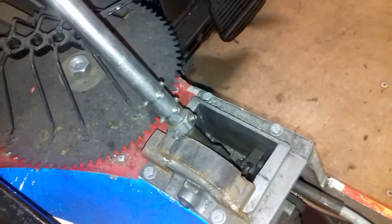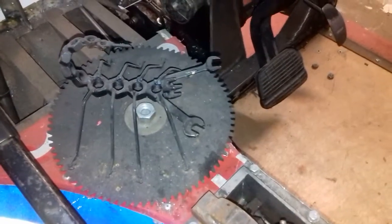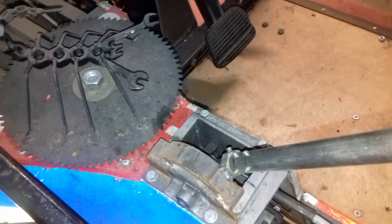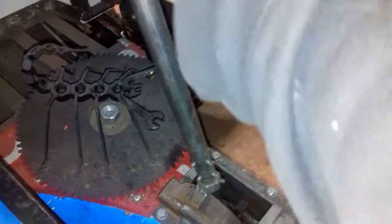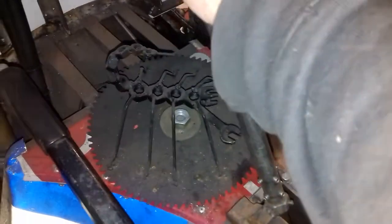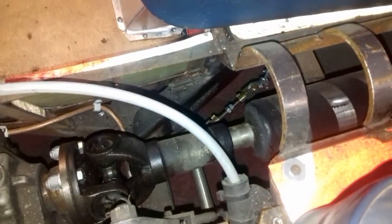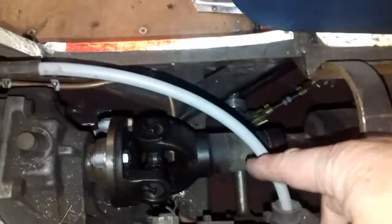The gear stick is actually all functional now. It's a four-speed — when I bought the gearbox I thought it was a three, but it is a four. This adapter piece there wasn't actually made for this rat rod — I made it for a hose connector, found it in my box and it actually works now. So you have to lift it up to get it into park, normal stuff. I haven't actually marked it on here, but this gearbox is a four-speed. This shifter is from a Rover — my offroader — so I had to play around with all the mechanism inside, and it does actually work now. You can feel it clicking in, and when you get to drive, reverse and park, that's what it should be.